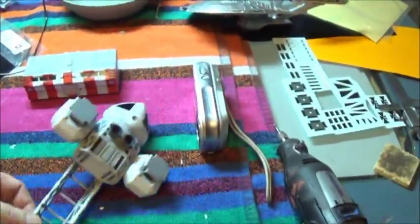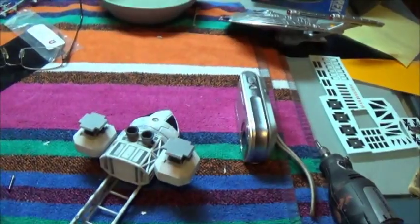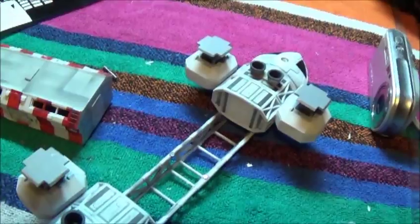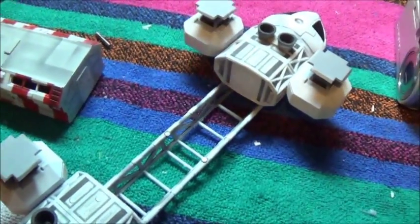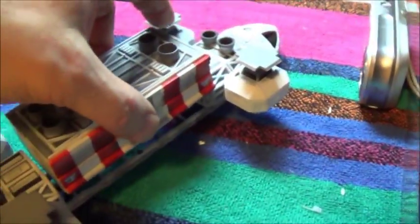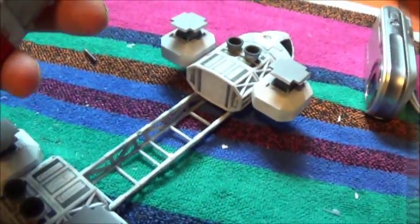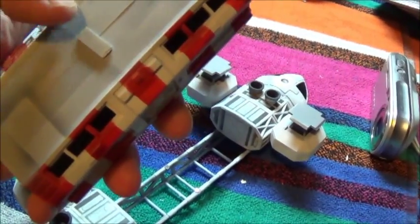But there you go. Now the next thing to do is to match them up to what's going to go on the top here, and that's easy enough. I'm putting some magnets on the actual magnets that are stuck there, and a little dollop of white paint, or you could use white out or something. You could even take just a Sharpie and just mess them up a little bit, so that when you put this in place over top of it, because those are raised, they will transfer to the exact spots where you want to drill your holes, because I'm going to put holes here where the magnets are going to be recessed into.